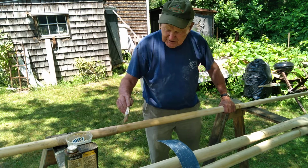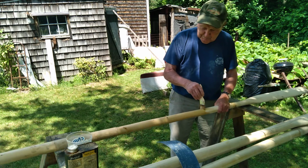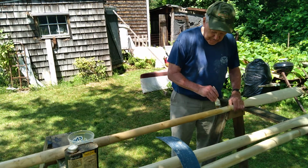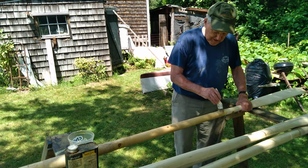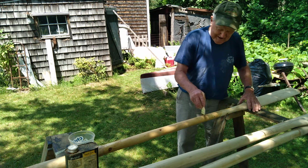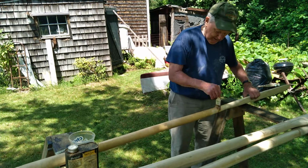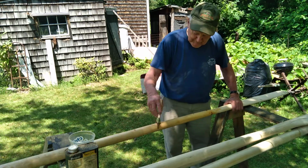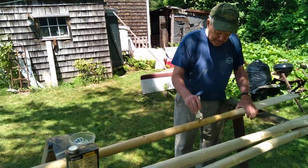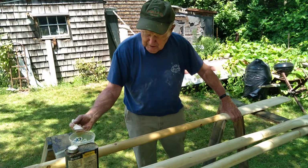Blades are at the end of this plank. The blades are 4.5 inches wide, and the handles are only 2 inches. So they go down the center of the 16-foot plank, past each other, a total of eight inches. You want as much weight as you can get up in the loom, up near the handles, to compensate for all the oar sticking out in the water beyond the oarlock. You want to balance them out.